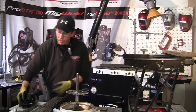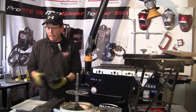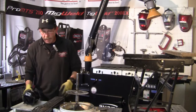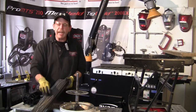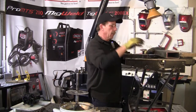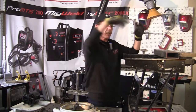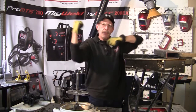With the motor, I'm going to mount it on a piece of Delrin — it's a plastic, like a PVC — so we're going to make a mount for that. It keeps it insulated, and it also helps with vibration. We're going to put that on our tube, and I'm going to drill and tap some holes just to hold everything in place. That goes on top, and then the other board I've got to make will clamp it in nice and tight. Everything will be right there on the tabletop, and you can take it off when you need the table for something else.